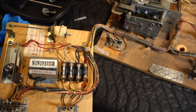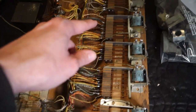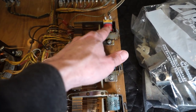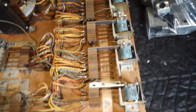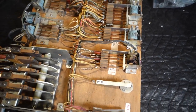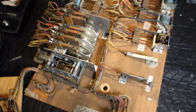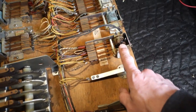At the back here we've got a 110-volt coin relay coil — it's red because it's 110 volt. You also have to ask about these red markers on here; those sleeves indicate 110-volt circuits, just the way the game was designed back then. Not the safest in the world, but something you've got to watch out for. Be real careful when the game's on and you're poking around here.